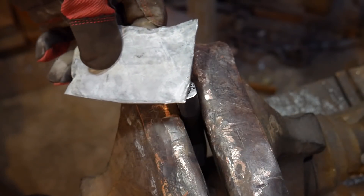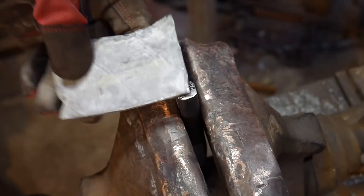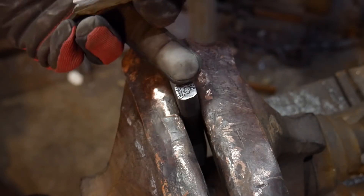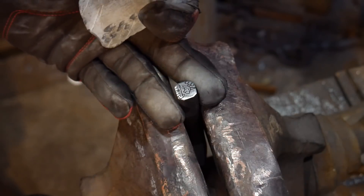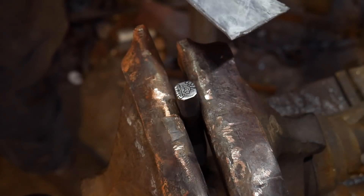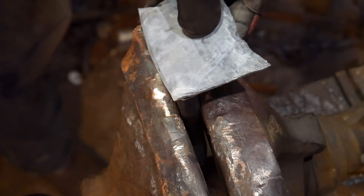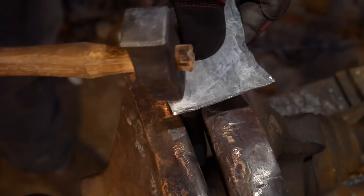Although with wheel weights, they may have a little bit of zinc. We're not going to drive the stamp directly because we're assuming this piece has not been hardened and tempered yet, and we don't want to start mushrooming things about. So instead, we're going to put the piece of lead on top of the pattern and then hammer down lightly.